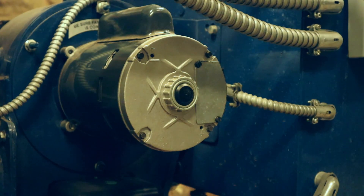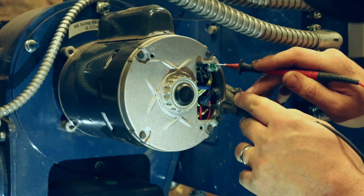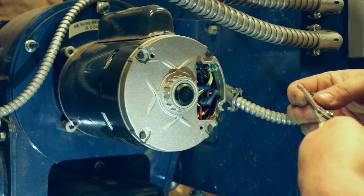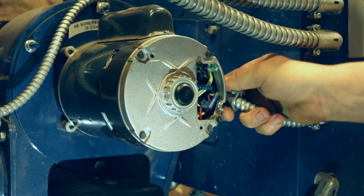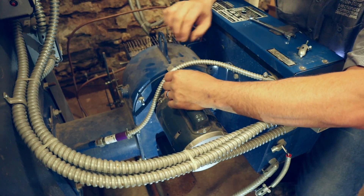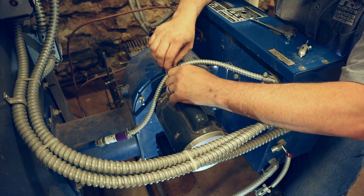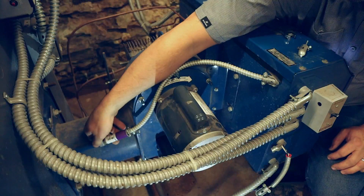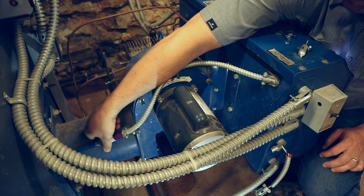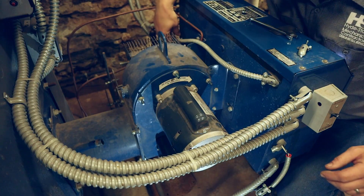When we put the new one on, everything works. No power. We shouldn't have anything on the neutral line, but I check them all in case you're back-feeding through a winding. The first thing that gets unbolted is this UV sensor. This UV sensor does the same thing that the little CAD cell in your regular oil burners does — it senses the UV rays off of the flame and tells you that you have flame. These just go on hand tight. There's just a little rubber bushing in there and then you have the eye itself. Set that aside because you don't want to break that.